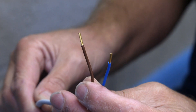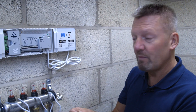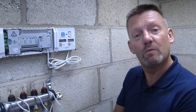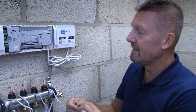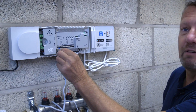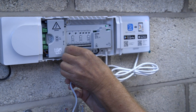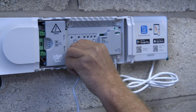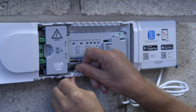The actuators come with two wires: a brown and a blue — typically live and neutral. It's not polarity conscious, so it doesn't matter which wire goes into which hole. The important factor is that you only plug one actuator into one actuator port. This is done simply by pushing the wire firmly into the hole, and it grabs hold of that wire. Once you've pushed the wire fully home, you can secure it into the mounting bracket.